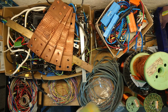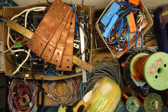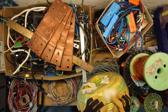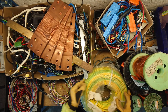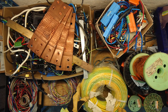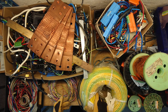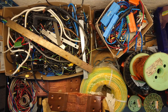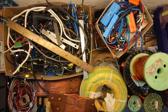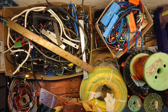Another thing that you can find on scrap yards is whole spools of high quality wire. This is some 16 square millimeter — 17 kilogram was the spool. But the good thing about that is you can just buy it for scrap price, so that's one euro a kilogram. So paying 17 to 20 euros for a spool of 100 meter 16 square millimeter wire — that's just insanely cheap. And it's always useful for a Tesla coil to have such large gauge earth wiring. So I hope you enjoyed the video I thought I would never make — just a quick rundown of what I have saved from all different kinds of teardowns and stuff I would like to use in a future project. So until next time, see ya!